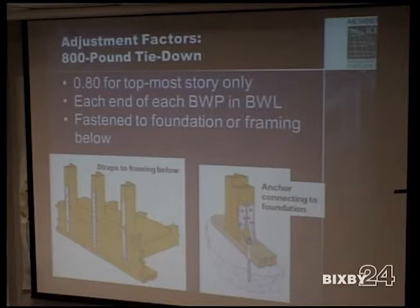Do you do it for stud top and stud bottom? Every other stud, top and bottom, but all the rafters to the top plates. We made sure they could properly transfer the load from one to the other.